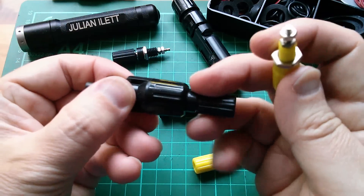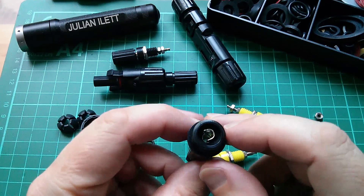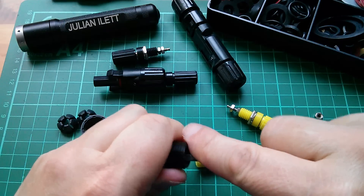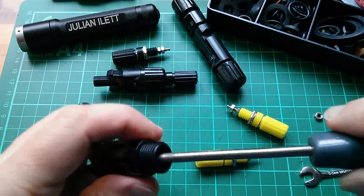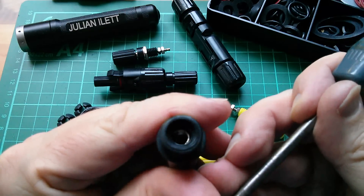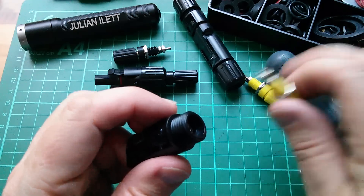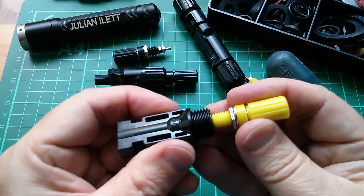I've done the black one already with the additional rubber o-ring in there, so I'm doing the yellow one now. The next thing I need to do is push that connector in there. Normally you wouldn't do this because you can't get these out once you put them in, but it's okay in this instance. That's pushed in. Now I need to put my screwdriver in and work it so that the wings of that metal splay out as much as I can get them to. Because what I need to do now is force that loose nut down into that piece of metal to make the connection.